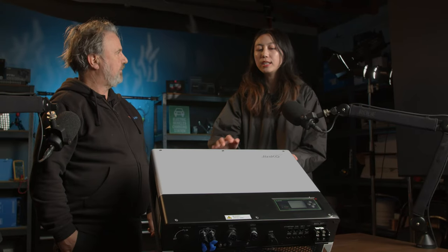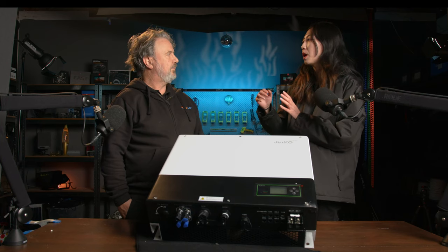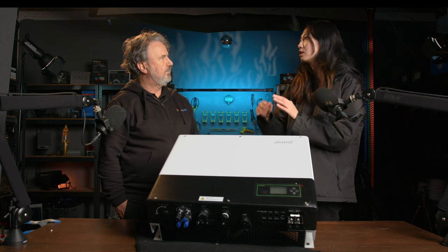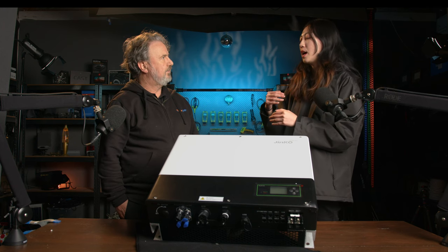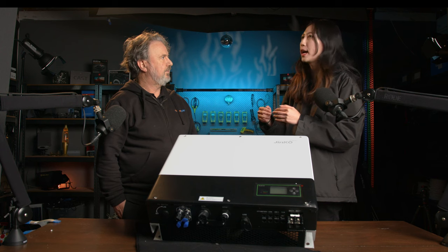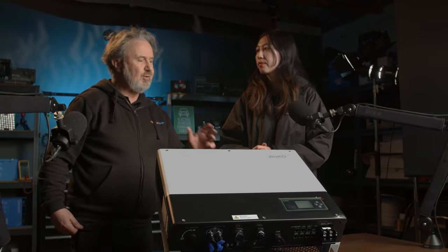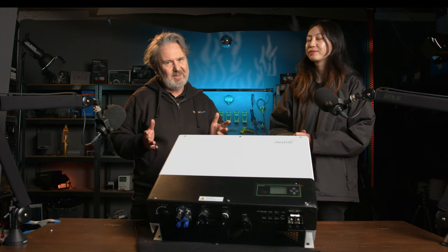Yeah, because actually there is a contactor inbuilt in this hybrid inverter, and usually it's connected to the AC grid port and can supply the power from the grid, from the solar systems to the grid, and do the multi-directional energy exchange. But if the grid is lost, it can be automatically turned to the EPS load port and turn on the backup mode. So the end users can choose some essential electrical appliances in their home, like the air conditioner, like the TV, like the fridge, that if the grid is lost, they will continue to operate under the backup mode. Yeah. That's great. So built-in transfer switch, you don't need another box. Yeah. Yeah. And I like the fact that you emphasize essential loads. I mean, sometimes customers get a bit excited. They think, I've got a battery, I've got backup, I'll just back up the whole house. But you still have to realize the limitations of a unit.